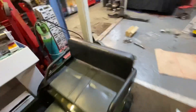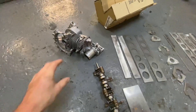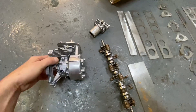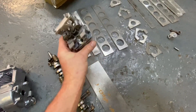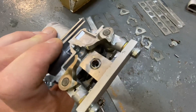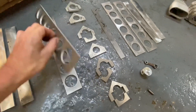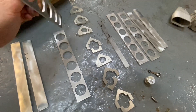So what I decided to do was make my own V12 using these GX25 Honda engines. Sorry if you've seen all this in other videos — just a brief overview: machining that piece down to this and then replicating it six times for each bank, running a shaft through for the camshaft, which is just a single lobe with two rockers on it. That is the laser-cut block in sections, so these obviously stand up on each side, and then there's a secondary one for the top of the block, closed off on the edges to create a water jacket.